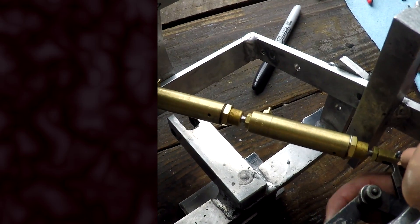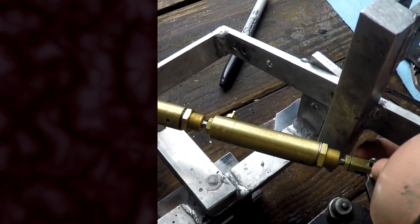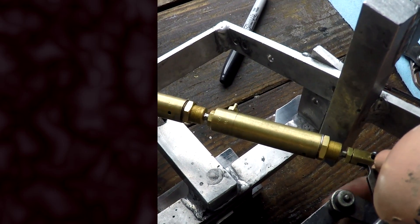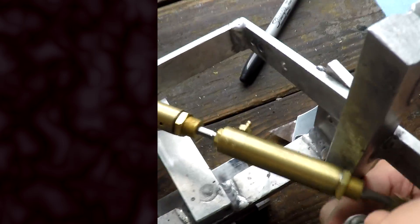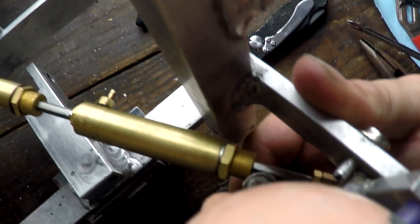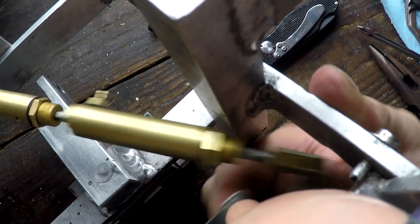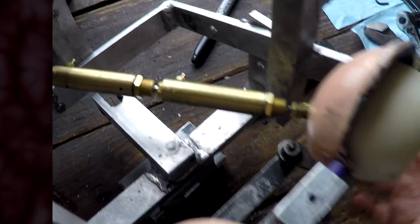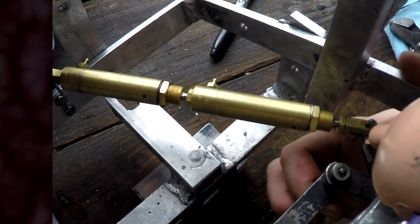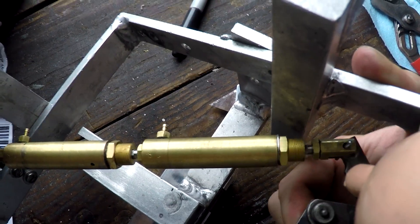On the new actuator I noticed the rod end was cut, so I had to cut that down. I also had to rearrange the washers — I wasn't paying attention when I took it out — to move this back a little so that when it came all the way forward it wouldn't bind right there. To tell you the truth, I remember it was binding right there when I first got the figure. You don't want any bind because it'll just tear itself apart. You want the actuator to actually reach its limit, and that's happening now.